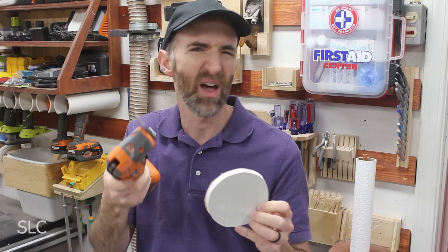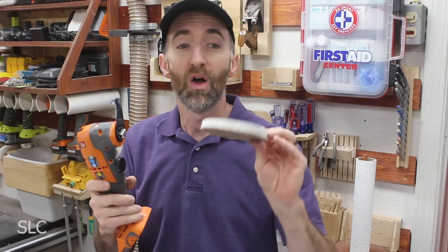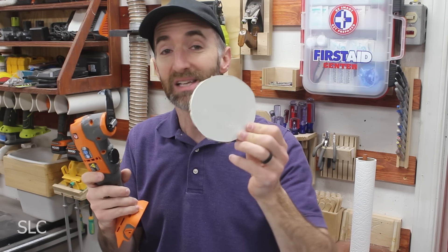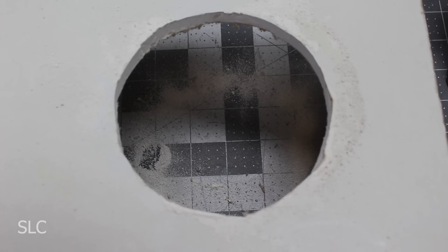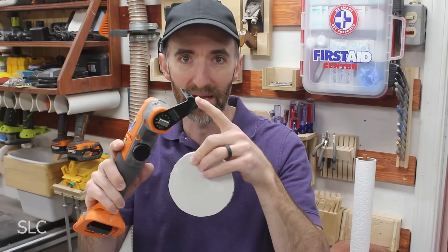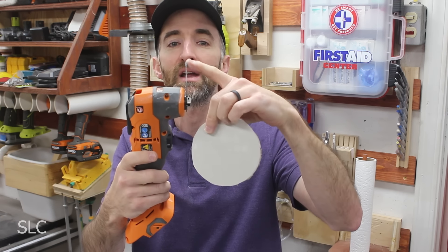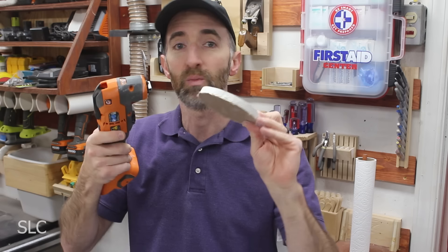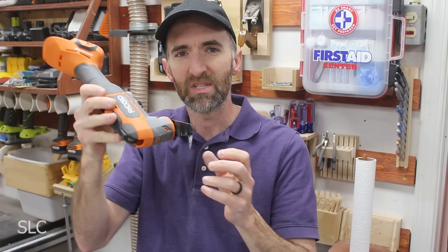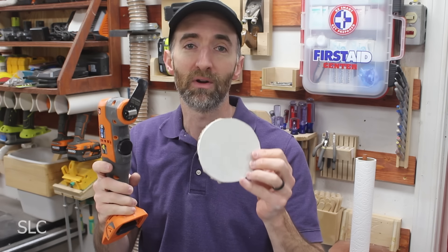Once I recognized that issue, when cutting out the circle I had far less paper still attached on the back — just a couple spots I had to go back over. Does it cut a round hole pretty well? I would definitely say that is pretty round. It's not perfect, but remember we're using a straight blade, not a curved blade. I did have to lift it up a few times to get the curve started, but overall this jab saw is a really cool blade.